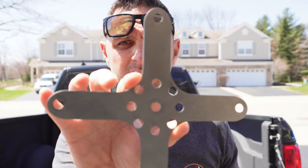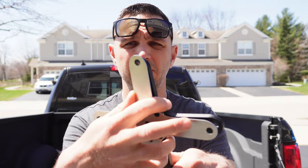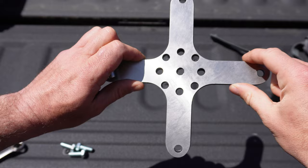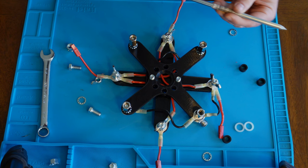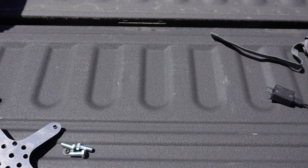We're going to take that bottom plate — I did something a little different during this build. I designed and had these special stainless steel, very thin plates made. They're going to sit on top of the plate that we 3D designed. Linked below is my Thingiverse account where, if you have a 3D printer, you can download the files and print them yourself. Now I place the stainless steel plate on top of the 3D printed part. This is going to add continuity throughout the whole plate where the antennas will go, so I no longer have to jump my Hamstick Commander with wires.